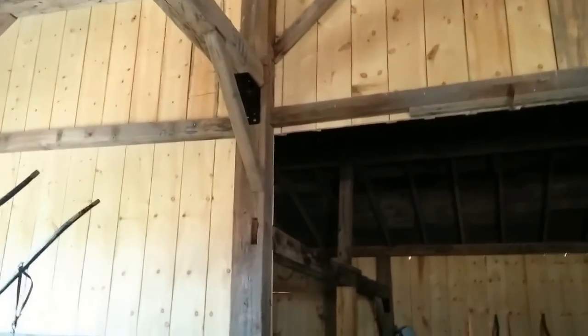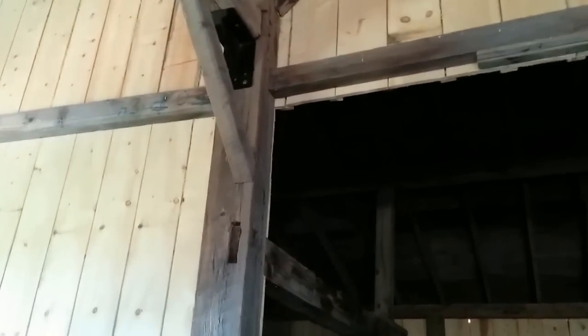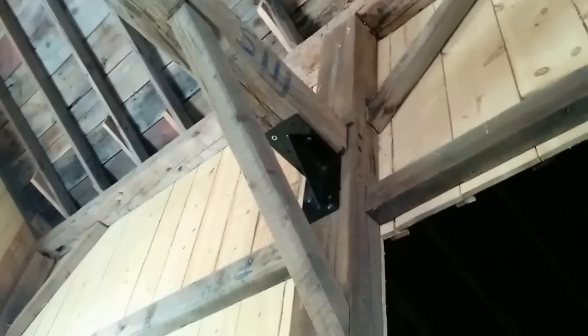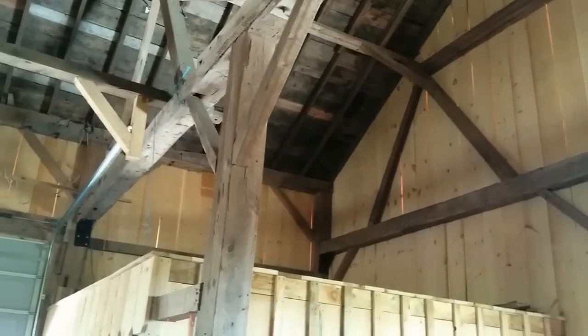On the floor here, he put new boards down — these are two layers of inch-and-an-eighth thick tulip poplar. The owner owns his own sawmill, so he cut the boards himself. Yeah, it looks great. You can see right up in here he custom ordered brackets from us in order to strengthen the joinery in this barn. You can see them in the corner, but they don't stand out. I think that's a really good solution.